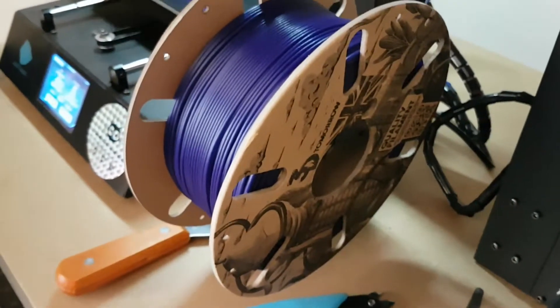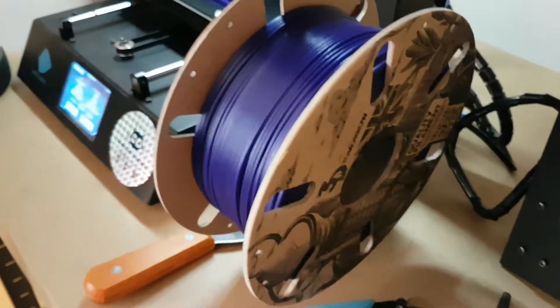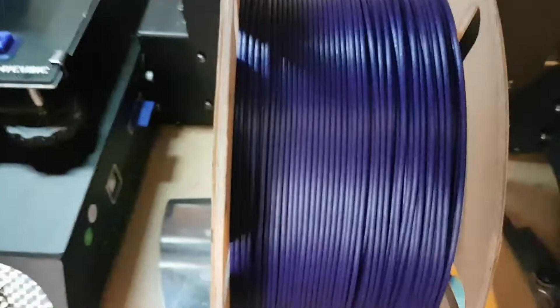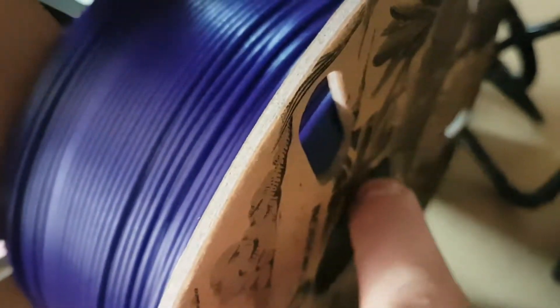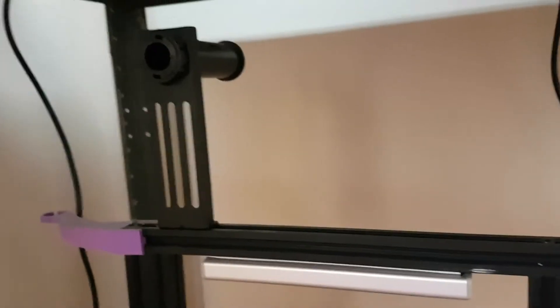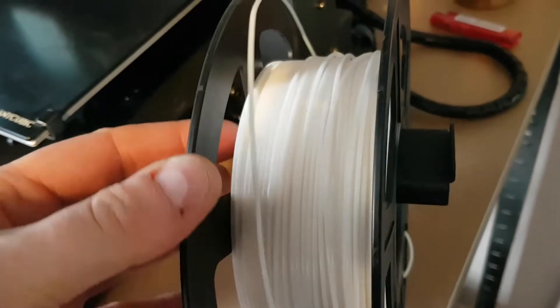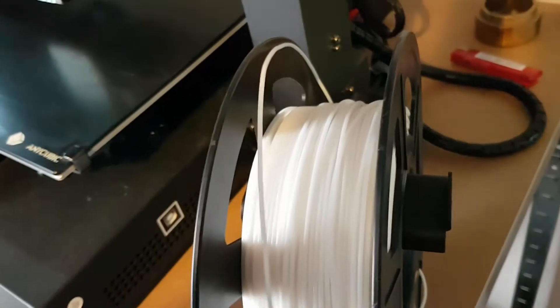I have been doing quite a few prints in this now. What I thought I'd do in this part is explain some issues I had when I first tried to print it. In fact, the reel actually fell off the printer itself — you can see a bit of wobbling there. The reel fell off because it's a very tight fit on these AnyCubic printers — you've got virtually nothing in there. Most spool holders, like on the Ender 3, are round with quite a lot of length so you can fit an extra-wide spool, but on these AnyCubics it's very tight.